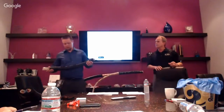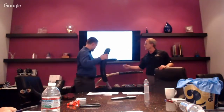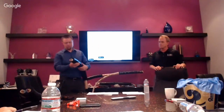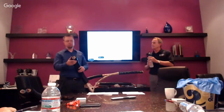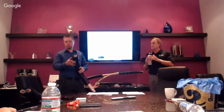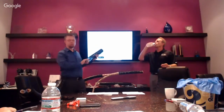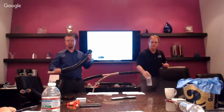So a 12-line bundle isn't necessarily much larger than this. And going into a 6-inch conduit, it's more similar to this. This has more insulation on it. Quick show. This is 3.25 inches in diameter. A 12-line product might be a half inch bigger in diameter. The radius is usually more about guiding the line through the sweep as it's being pulled, making sure it doesn't get stuck or break or fold in half.